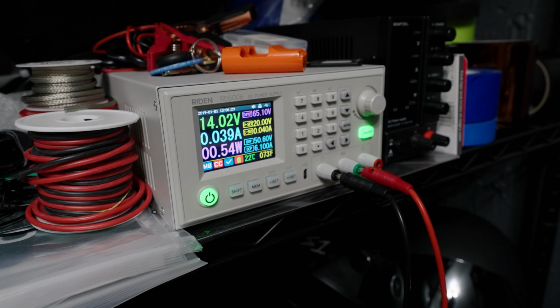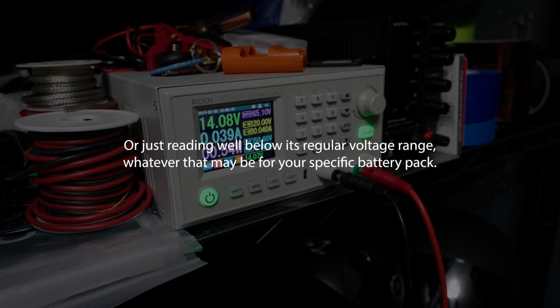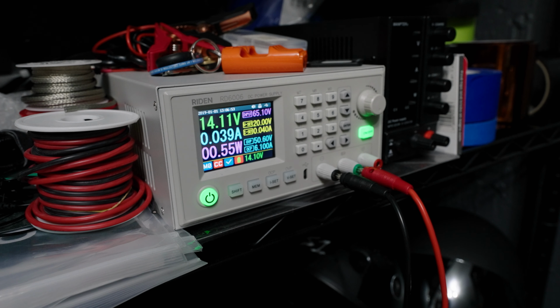And so that is why if you have a device with a very large, honestly any size, but especially a very large lithium-ion battery, and it has been drained, you left it on or you left it there near dead over a summer or a winter and it won't turn on, and you look at it and it's reading 1 volt, 2 volts for the whole entire pack, something like that. If it is flat dead, do not try to recover it.